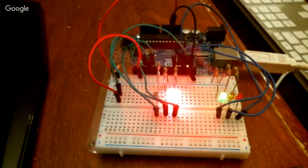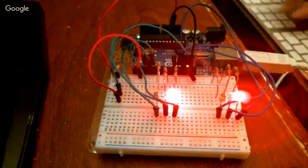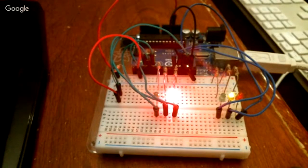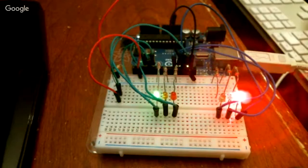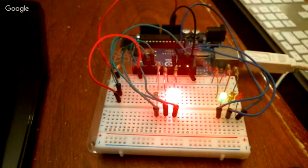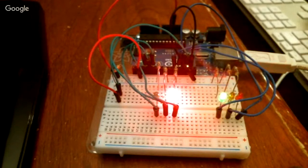Nice. If you hold on here real quick, I'll change this so that it's really fast. And Larry, are you running that from a PC or a Mac or Linux? I'm running that from a Mac. I used to have all Linux computers, now I have all Macs. But the Arduino software is built on something called AVRDude, and you can run AVRDude from the command line and upload to your Arduino. So you can create a sketch, edit it in Vim or whatever, and then use AVRDude to push it to your Arduino.